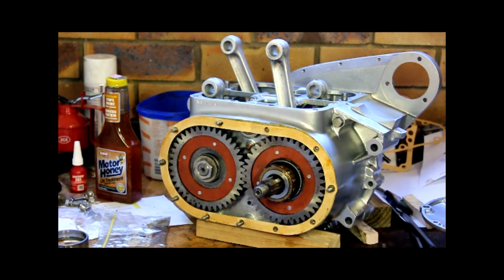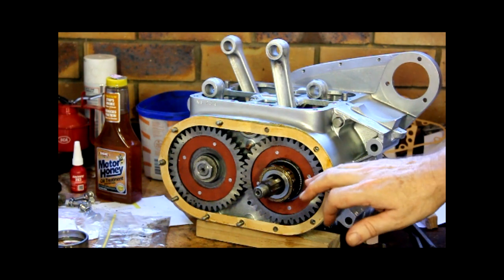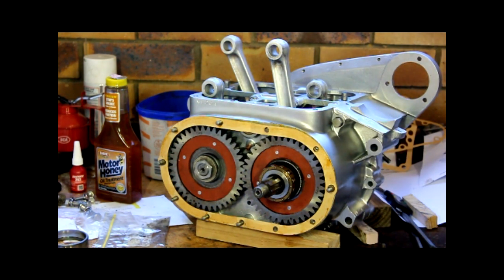Okay, so I've decided to leave the oil pump for next video. Otherwise this will be a video that goes on and on and on, and we'll never get to the end. Kind of like this restoration, really. So what I've done, I've put a chemical sealant on the crank nuts and tightened those up. The nut on the timing side rear crank, I haven't put a lock sealant on yet. I have done the nut up tight, because nuts you either leave visibly loose or you do up tight. You never ever leave them finger tight, because that's how people forget to do them up, and they come off later, and that is bad. So I've nipped that up, but we will take it off again when I need to set the cam timing.